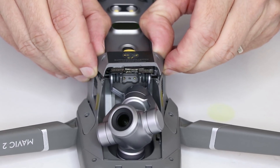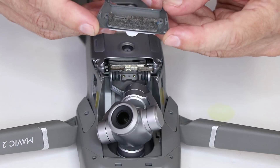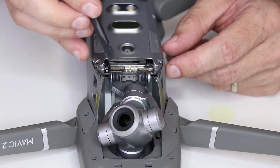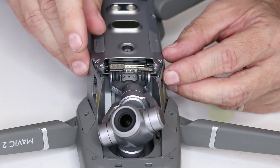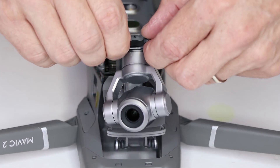As you can see there are two little pins — a pin here and a pin here. After that's removed you need to remove this screw and this screw. Once those screws are out you need to pop this ribbon cable up right here. Once that ribbon cable is popped up, the gimbal and camera assembly will simply lift out of the drone like that.